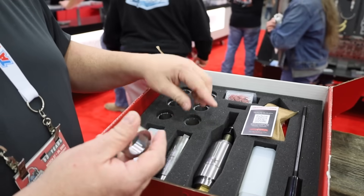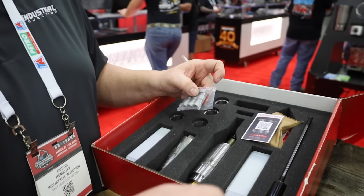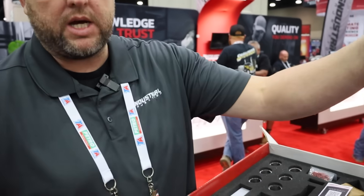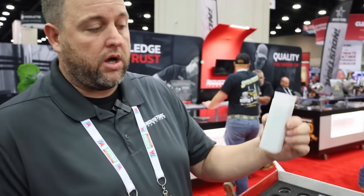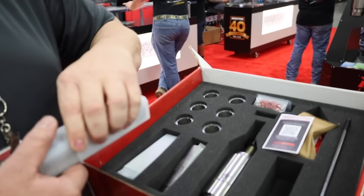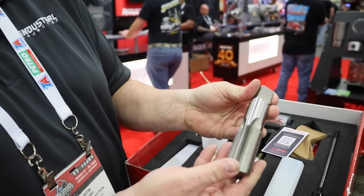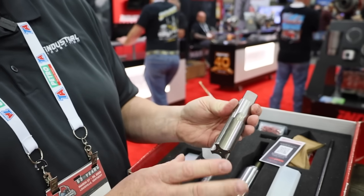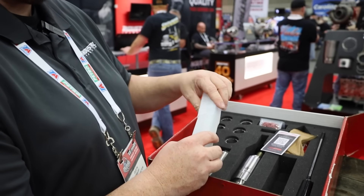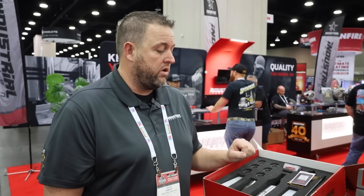We've got our patented six-cup design. We've added enough in this kit so you can do the complete job — putting six plugs in and doing all your machine work at one time. You're not doing one then switching everything over to another. You can use tap A to get all the cups threaded and pulled, then move on using tap B. These are really nice, made-in-America, hand-built taps — they last a long time and will do a lot of cups for you. We've spent the money on making quality taps.